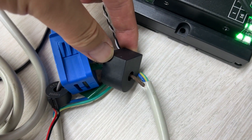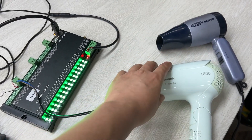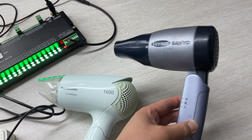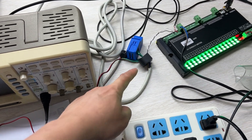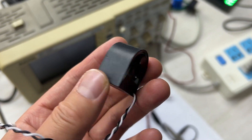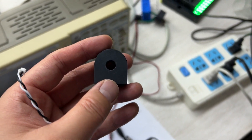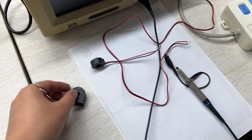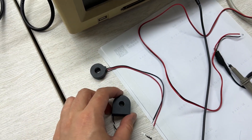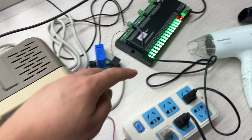You can see this is a very small CT clamp sensor. This one is also a CT sensor, but this one is anti-DC signal — sometimes we have tested this with a load, and this one works well but the other one has a problem, which I will show you later. Different CT sensors will have different results. This one is the best — it can reduce the DC signal interference because the output AC signal is mixed with DC signal from the load. The blue one is also small but outputs the original signal without any filtering. However, both the blue one and this one have some components inside to reduce interference.